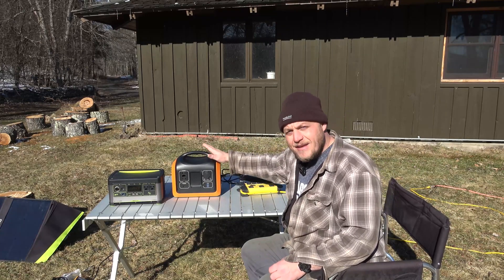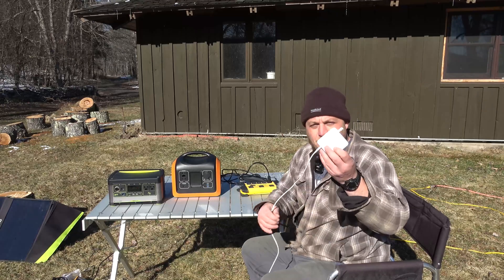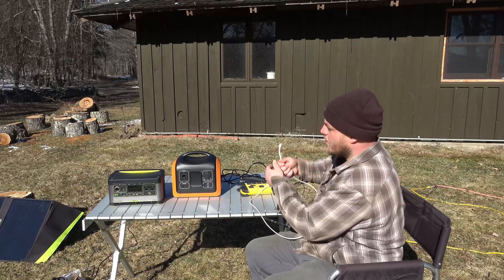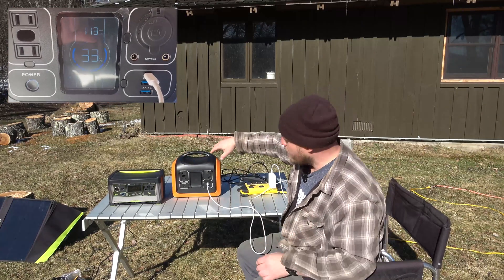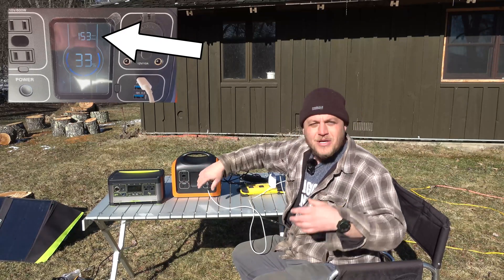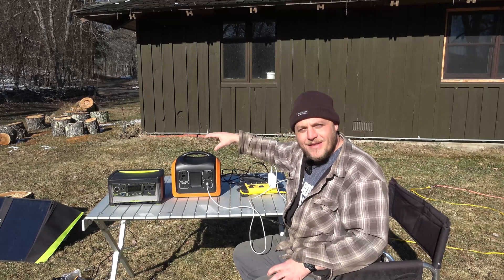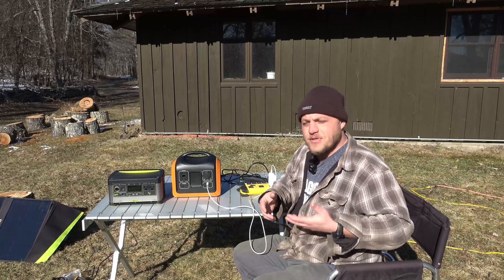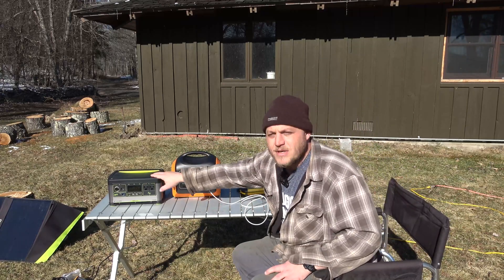This more inexpensive OPEZ model has a 100 watt charging limit — they give you a 97 watt wall charger, so they just about max that out. You can't upgrade this to charge any faster than 100 watts. But what I can do is take this charger that goes to my laptop — this is an Apple charger, but basically any block charger for a laptop or tablet that has a USB-C. I plug that into shore power and plug it into the power delivery port. This unit now went from 97 watts up to 151 watts. I'll take a cell phone photo and put it up so you can see this — 155% of the charge speed this was advertised as. That's going to take a three-hour charge and knock it down to two hours.